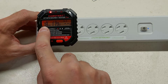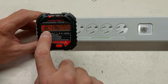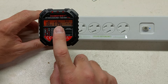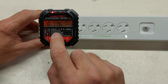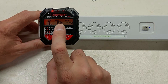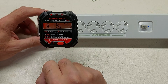Do we know if it's accurate? A simple way to check is if you have a volt-ohm meter or multimeter, you can test across the pins on the receptacle. What I like to do with my multimeters is know if they're out — every couple of months I'll take two or three multimeters and plug them into the exact same circuit to see if they all read out the same voltage. As long as they're not way off, I'll continue using them. This test tells me that if I were to change the wiring inside, I could use this in a North American circuit and save myself the shipping cost of returning it.